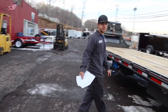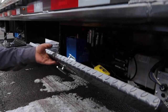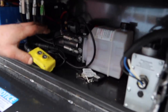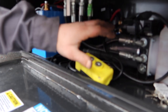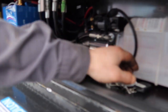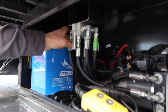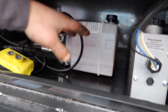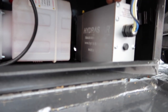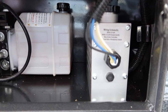With the hydraulic dovetail and the hydraulic jacks, you need a pump — down in this toolbox you have the hydraulic pump with another battery. This box and the air management box have battery maintainers you can plug into. There's a wired remote and wireless remote. This is a valve block to go from the hydraulic dovetail to the hydraulic jacks. Over here is the Hydrostar braking actuator for electric over hydraulic drum brakes on the 16k axle.